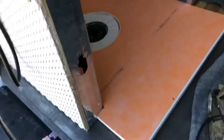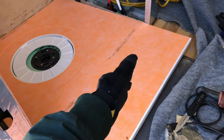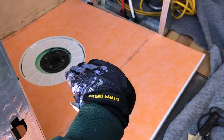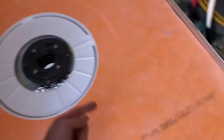So from my template I cut it and I left this long because the way this is designed, it's actually sloping towards the drain. So my idea was leaving this as long as possible will give me some floor slope towards my drain — it's not really, really sloped, but it is sloped. So I'm going to cut the floor around this and recess that so everything is even except that slope. What I did was there was a one-inch insulation underneath this floor sticking up proud about half an inch. So I cut all that insulation out — this was recessed into the floor about a quarter inch. Then I cut a quarter-inch piece of plywood and put it under there as a big spacer and floor support for the shower unit.